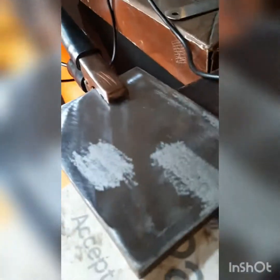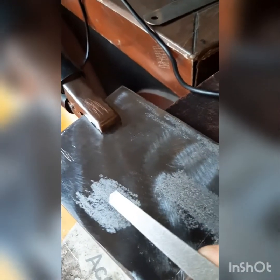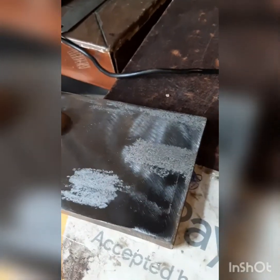The deposition is in microns, but it is so hard that even a file cannot scratch this surface — when you rub here it will damage your file. It is almost about 72 HRC-plus. So deposition is in microns and does not change much of your dimensions, but gives you a very hard coating on the surface.